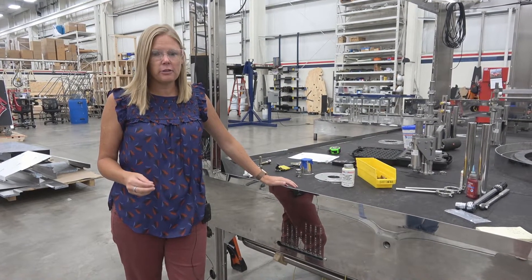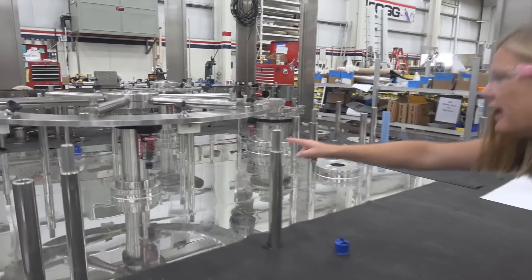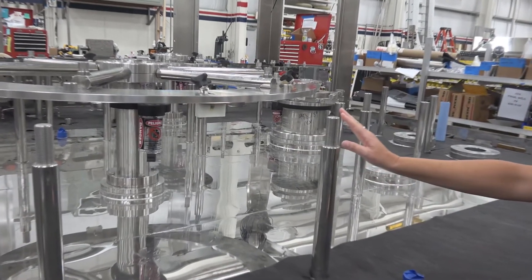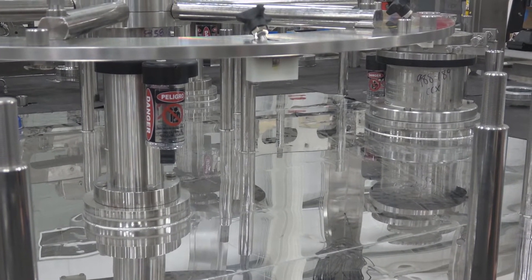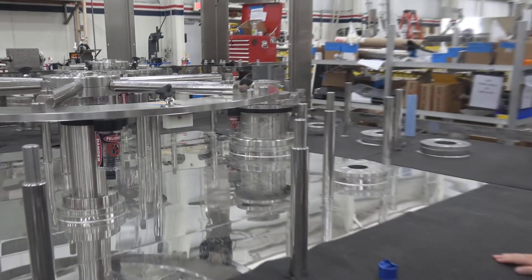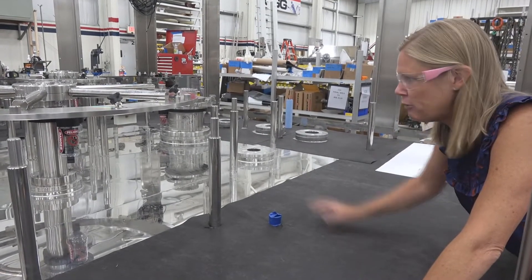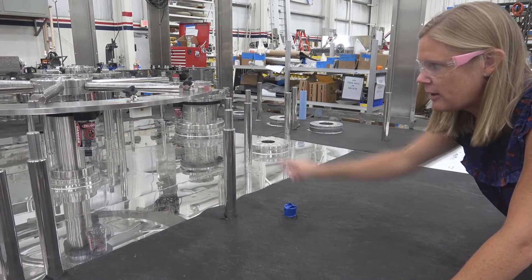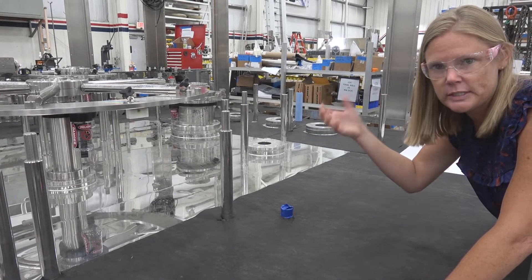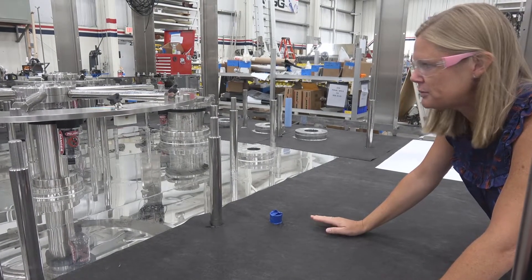On these newer fillers, another thing that we've improved is that they have these cups — I'll show you over here. That cup right there is a great clean visual for you to know if you've greased it enough. With a filler-capper combination of such a big size, if you're over at the grease bank greasing, it's best to have a co-worker come and help you and say visually, 'Yep, okay, you're good,' because you'll be able to see movement of grease in that container. When that container gets full you can just twist it off, throw it in the garbage, and twist a brand new one on. Super easy, super clean versus what we had been doing in the past.